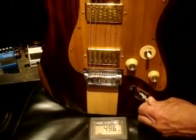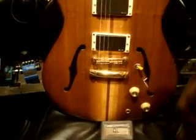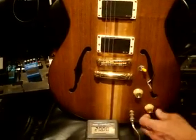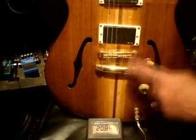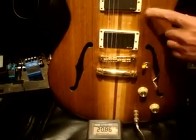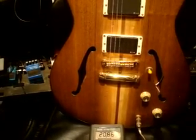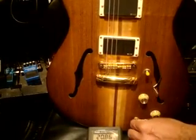Okay, this is just showing you some different guitars and the ohm readings we get out of them. The last one I wanted to show you is basically a humbucker, but this would be an EMG active humbucker. So make sure our volume and tone are all the way up. You can see here, these ones we're getting a very high reading, 20, almost 21 ohms on the neck pickup, and basically the same on the bridge pickup. Put it in the middle, and we get about 16 there.